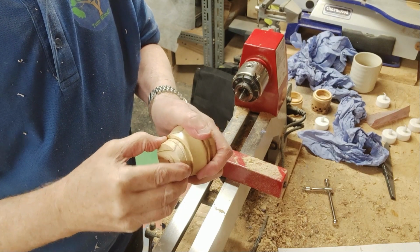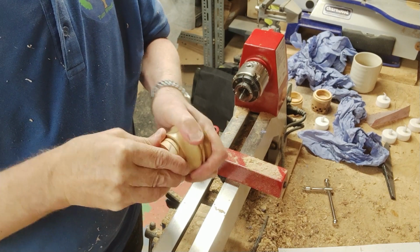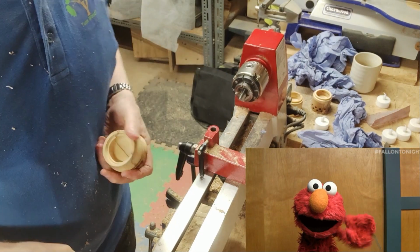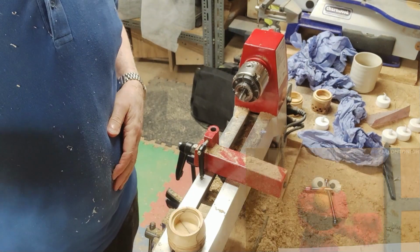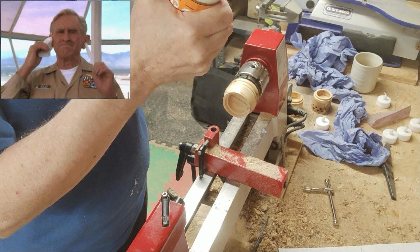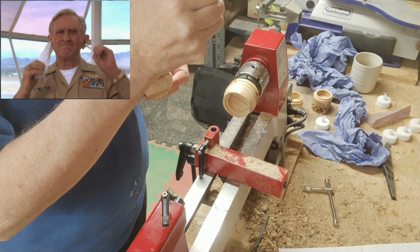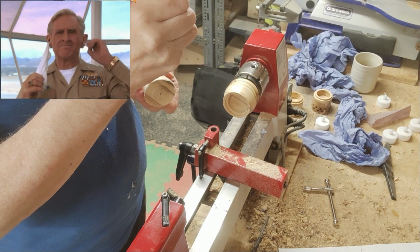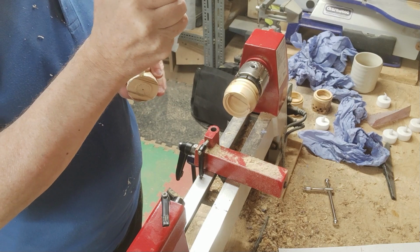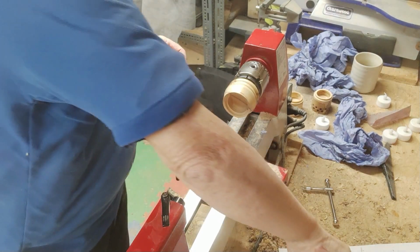Here I'm gluing in an insert that I made off camera so that I can create a spigot in the base of the tea light holders and not a recess, which I'd done previously. The result being, the only way it could be assembled would be by placing the tea lights themselves upside down in their holders so the light wouldn't shine through the holes.